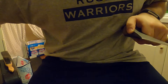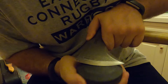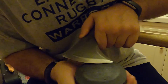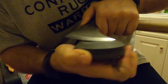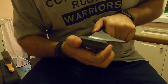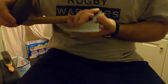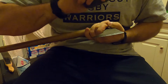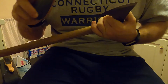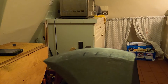A trick you can do is put a little bit of water on it — you'll see the water kind of splash up on the edge of the blade, and that's how you know you're hitting a consistent angle across the entire blade. If you're not seeing that splash on the edge, it's likely you don't have the correct angle. You can also follow the scratch pattern to see if you're too far forward or too far back. This whole process is for the final edge of the blade.